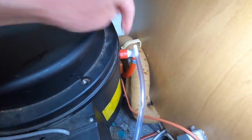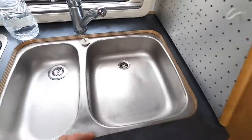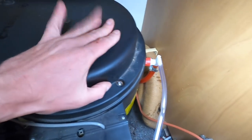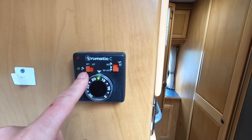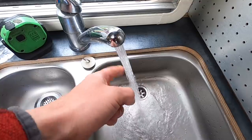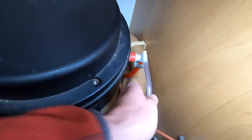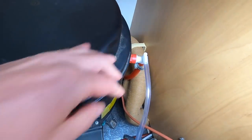That's much better. Let's give this another test - fill the boiler up and see if any water comes out. There's the hot water coming out, so the boiler's full. And there are no leaks now. Let's get it nice and hot and see what happens. The boiler has now finished heating up - it's set to 60 degrees. Let's just try the tap. Yeah, that's hot! In here I'm not seeing any leaks, and nothing's coming down the breather pipe.